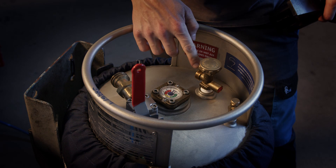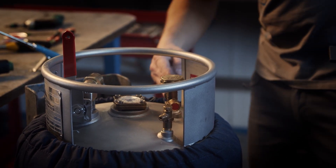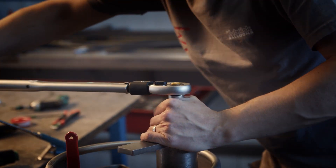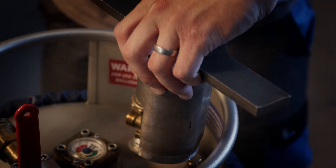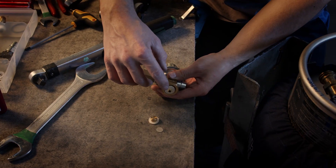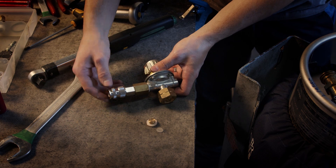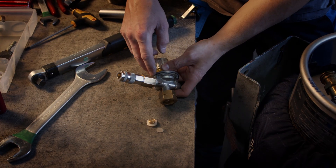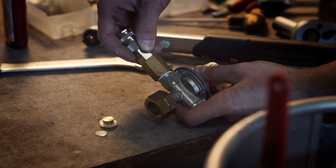I have to take care of the direction of this side of the valve, because the valve has to be in this direction. I will use a torque wrench. If you had leaking between this part and the valve, you have to change the sealing ring. You can have another leaking here or here between these parts — in this case you disassemble it, clean the thread, wrap with Teflon tape, and put it back and tighten it with a torque wrench.